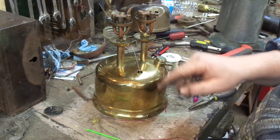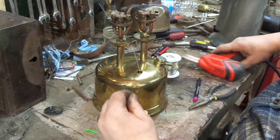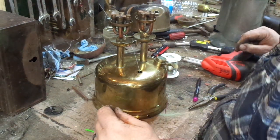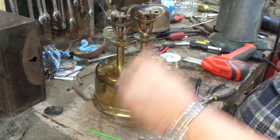That's got to be clean because you're going to be applying solder to it. After you cut your plug, make your backer piece, put it on your wire, and you want to tin it for soldering.